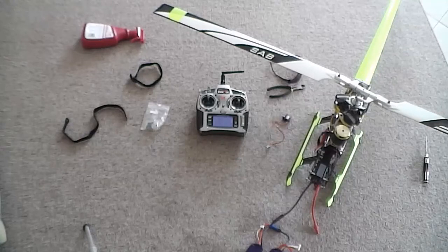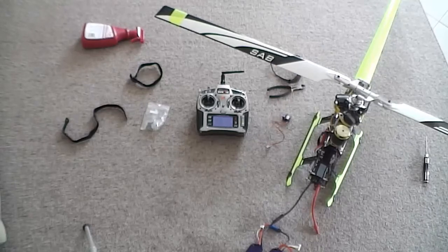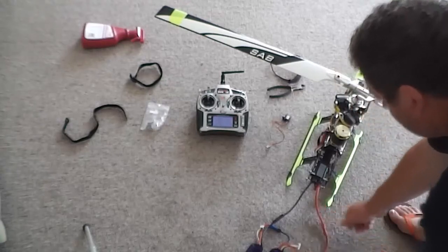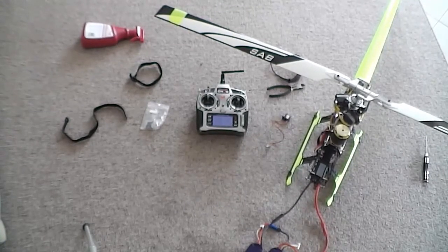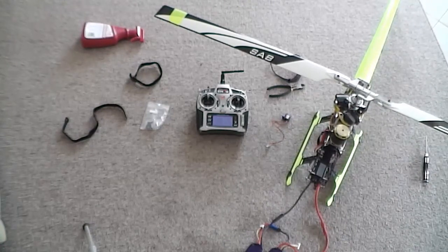Wait until that initialises. Okay, that's all initialised. Now I plug in my batteries — 44.4 volts. Okay, and it does nothing. That 12 counts was how many cells I've got — two 22.2 volt 6S batteries. So now we've got to proceed because it's not going to go anywhere anyway. I've got the belt disconnected — always remove your belt so that you can freely spin your motor without the blades taking off.